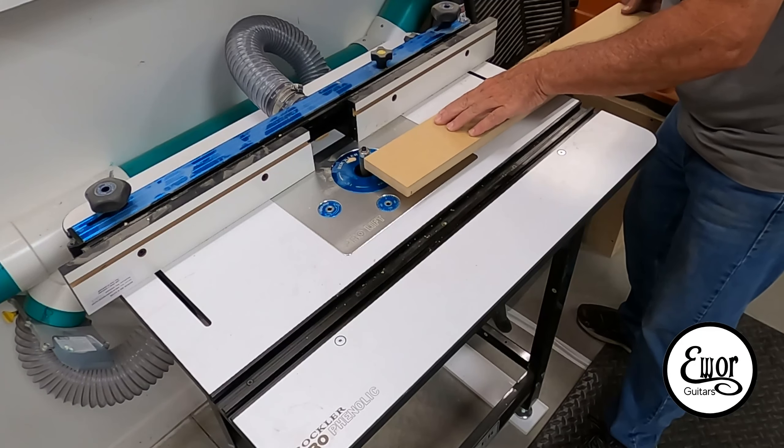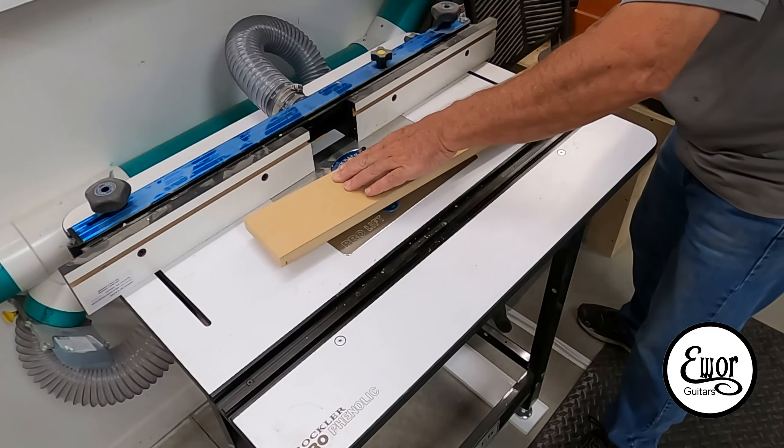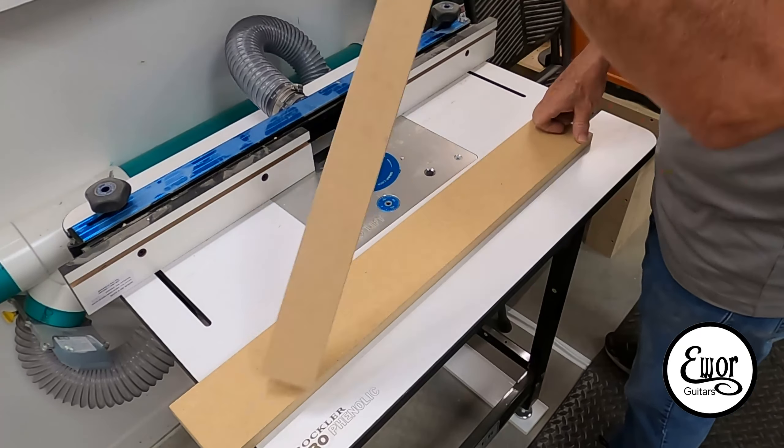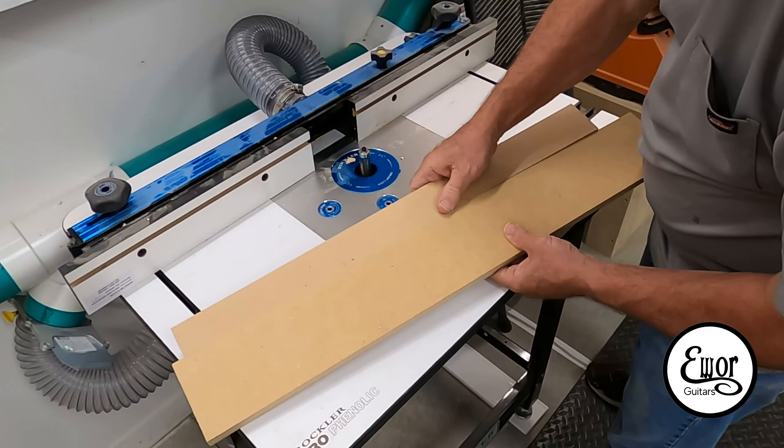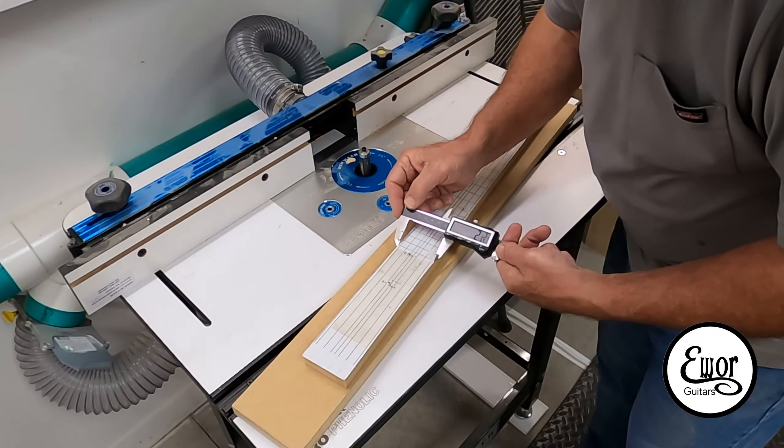That double-sided sticky tape works perfectly for this type of thing. When I stick a straight edge like I'm doing right here, I try to split that line right in half — take the pencil line and just split it right in half, trying to be as accurate as possible. That's a great little router table. I've got the vacuum line coming in the back of the fence and one coming up from the bottom — almost no dust is coming off that thing whatsoever. It really works well. Checking it here for straight — it turned out really well, I was very pleased.